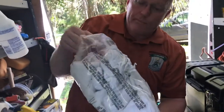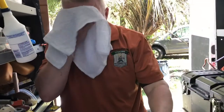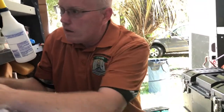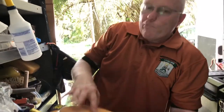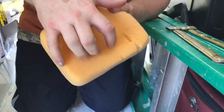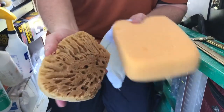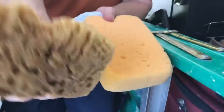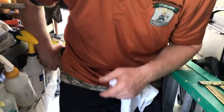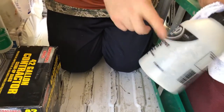Many of you have commented on me using rags while I work. I do not recommend wiping down wallpaper with rags - use them when you sweat. What I recommend are sponges. The sponge should be about 30 percent wet - it grabs the glue on the wallpaper and sucks it into the center of the sponge. That abrasive approach takes the glue right off. It costs a few bucks but it's well worth it.